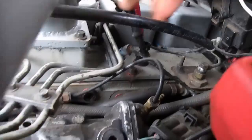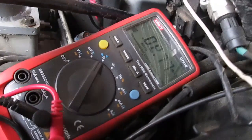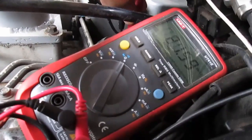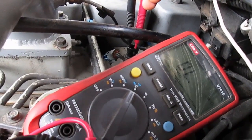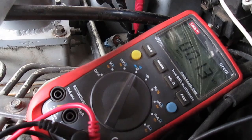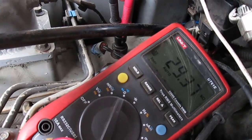So we're going to poke the probes at the sensor pins and see what kind of reading we get — trying to get it so you guys can see the multimeter. It's pretty chilly, actually only 40 degrees. I just poke around in there until I get a solid reading. There we are — solid reading. We're getting 29.37 kilohms. That is what we're looking for.